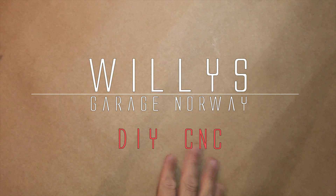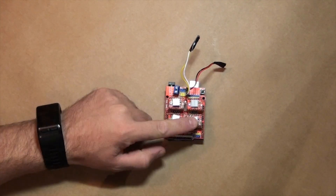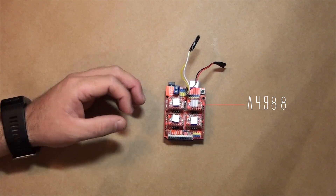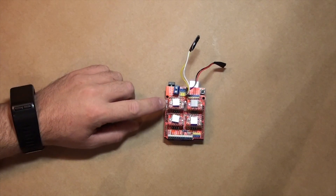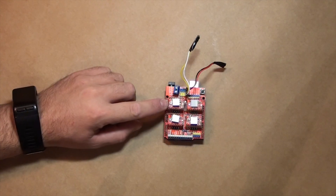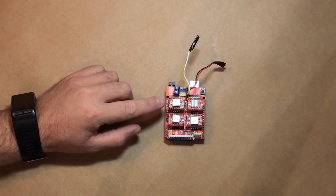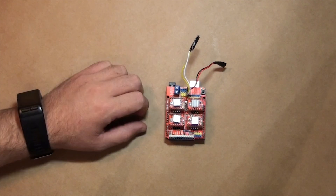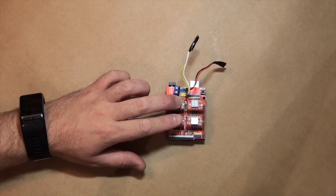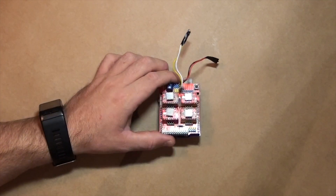As you may have watched in my previous videos, you know I have some problems with my CNC shield and these stepper motor drivers. They are too small to drive my motors. I have the NEMA 23s. I tried to regulate the current by adjusting the potentiometers on each controller. You have to be very careful when doing that because the potentiometers are easily damaged. But anyway, these stepper motor drivers don't work for me. I need something much stronger.